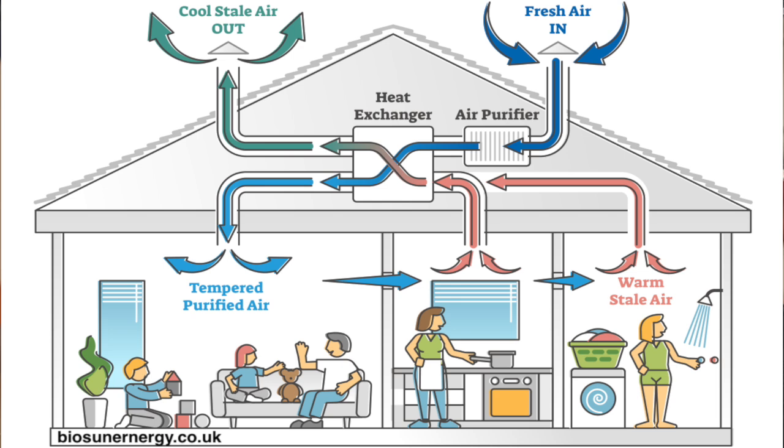It's much better than passive air heat recovery systems, because the input air is much warmer and the output air is even colder than outside. This is a small-scale version of industrial heat recovery. With just 140 watts of electrical power, the system can recover about 500 watts of heat, thanks to the heat pump's high energy efficiency. And because the outgoing air is already warm, the system can achieve an even better COP — coefficient of performance — and maybe we get even 600 watts.